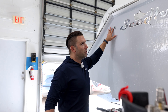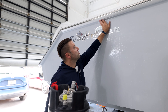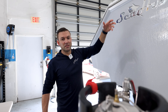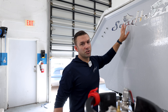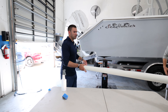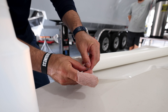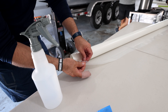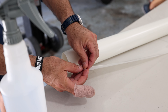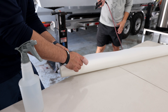Double-check any emblems or badges — this one stays on for this install. Go around and feel with your hands as well. Magic eraser is great at cleaning around all the edges and borders. As we unroll, we stay close to the boat. Pull the cap sheet off first while we have the table here — put a little crease in the edge, flip it back, and that makes getting the edge much easier. It's all hands on deck, so spray as we go.